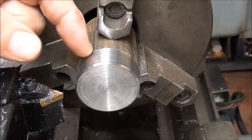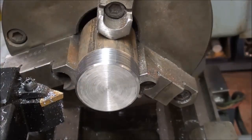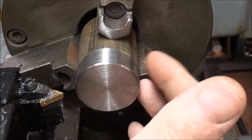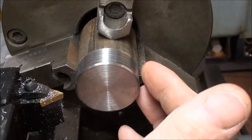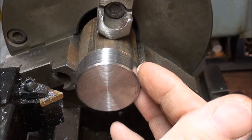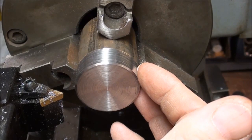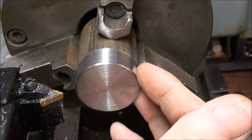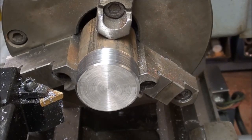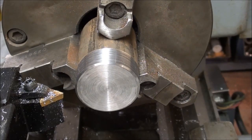I'm going to cut it off so it's about a half inch thick. However, I'm going to saw it off — I just do not like to use cutoff tools on larger stock like this, especially when it isn't very free-machining steel. I'll do that off camera, then put it back in the lathe and face the sawed side, because the finish will be terrible on that.